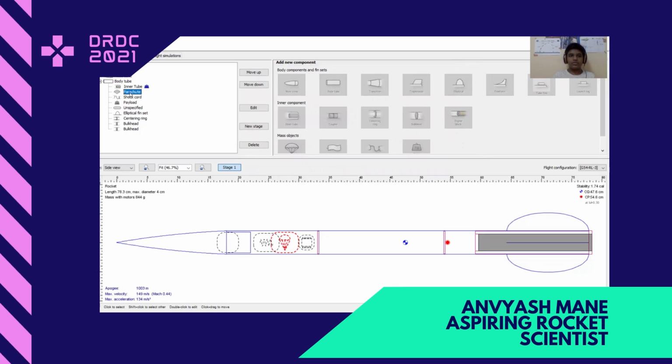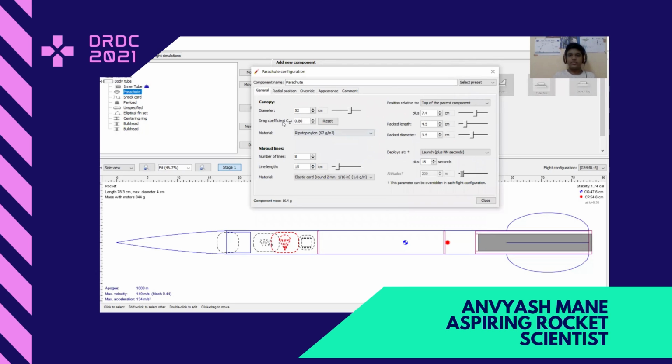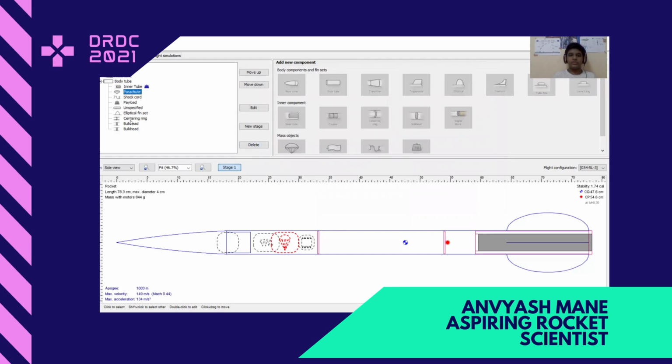After that, coming to the parachute itself, the parachute diameter is 52. Drag coefficient is 0.8 and material is ripstop nylon, as it is strong. Number of lines is 8. Line length is short as it will take less time to open. Then bag length is 4.5, bag diameter is 3.5, and deploy is at launch plus 15 seconds. I have taken it from the launch data, not apogee, and I'll tell you why I have taken this.